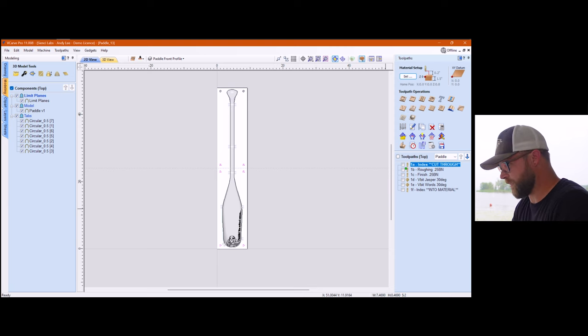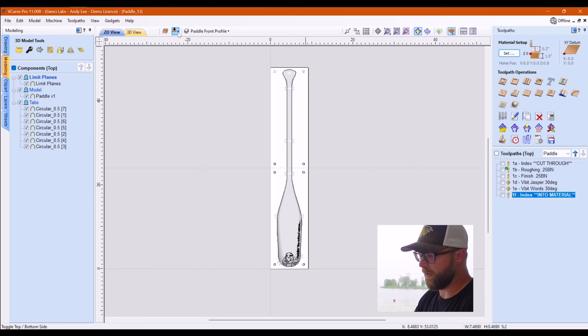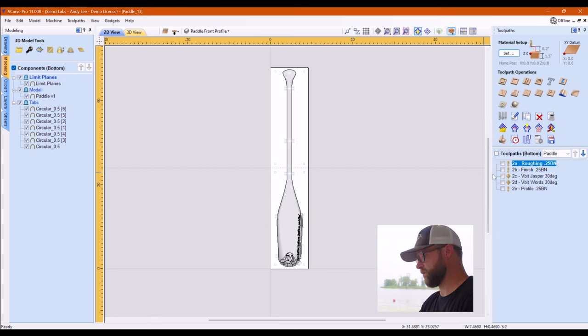Now this is just creating the final 2 index holes. You can't obviously create those ones on the initial carve because it's not 48 inches deep, so it would run off the end of the thing and it would do the weird grinding motor thing. And if you want to know how I found that out, ask me, because I did it once by accident and I lost my zero and it was a mess. So that's why that is its own little independent guy. You will not carve that until after you have made your slide. The back is identical to the front.